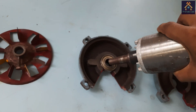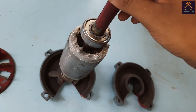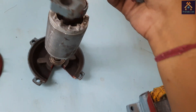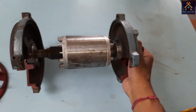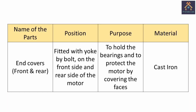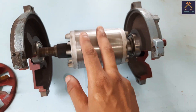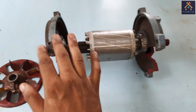The shaft and rotor part will be placed inside the stator, the end cover is then fitted, and the rotor is free to rotate inside the stator. The main purpose of the end covers is to hold the bearings and to protect the motor by covering the faces. There is a few millimeter air gap between the stator and rotor to reduce leakage flux.